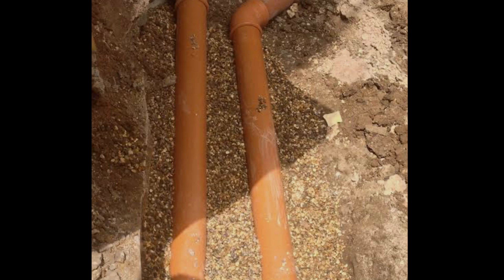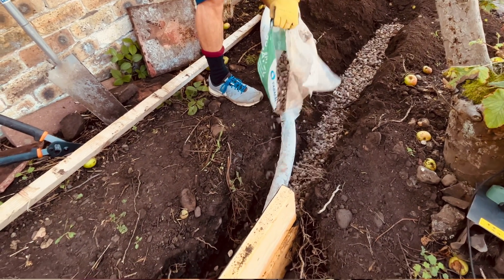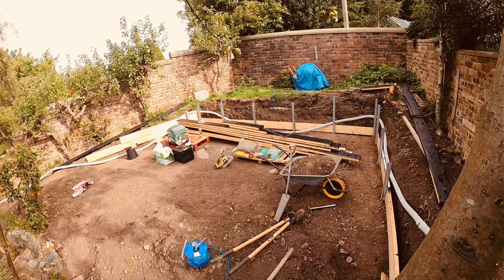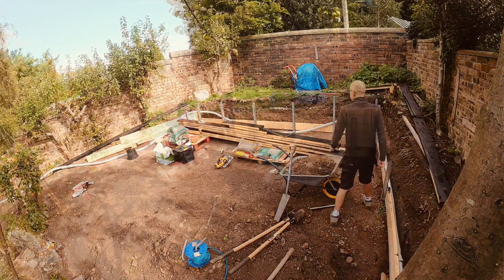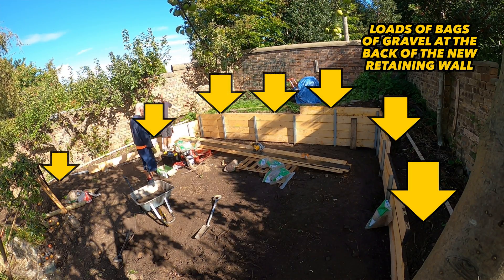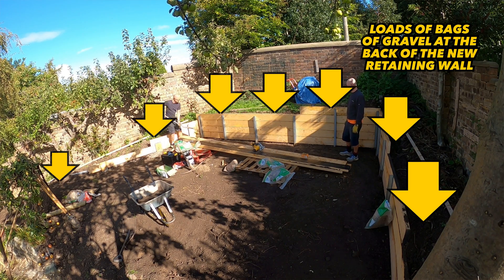If I was laying conventional drainage pipe I'd be much more exact about the fall — adding a layer of pea gravel to bed the pipe in and get a constant fall of around 1 in 40 to 1 in 80. But because we're dealing with the push of water through pressure rather than the fall of water from gravity, I'm not worried if the gradient isn't perfect, so I'm not bothering with pea gravel here. Then I lay the pipe on top of the gravel base and cover it in more gravel, creating an environment great for percolation so the water finds its way into the pipe and is carried down the hill to our soak away.